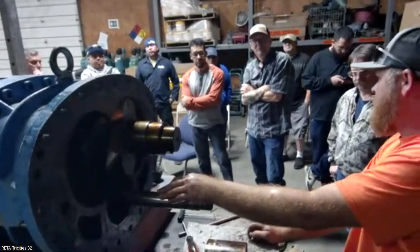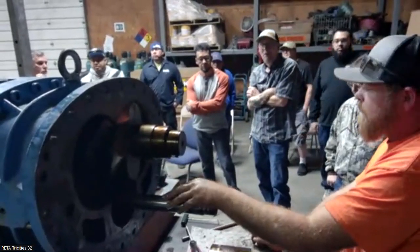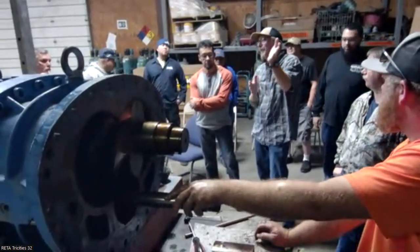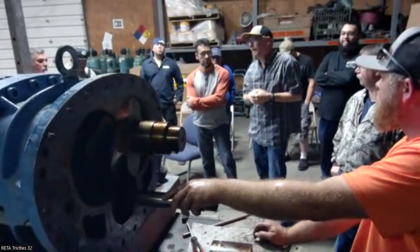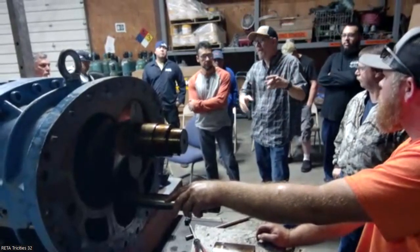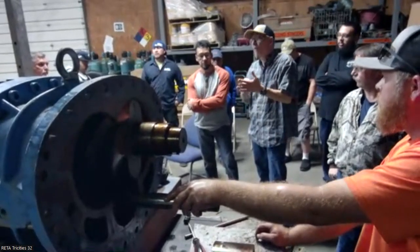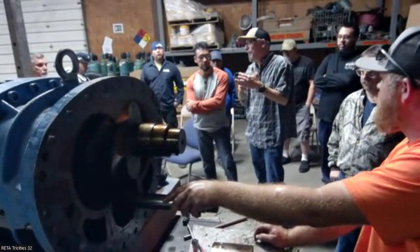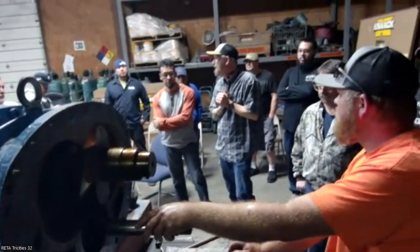They're gonna flag it as it's got a gas flow. What I wanna know is if we make a change in our process, how we're defrosting, and all of a sudden I've got a compressor that's starting and stopping 12 times a shift, because we made a change in our process, what's it doing to that machine? That's why I'm pushing for at least baseline monthly readings.